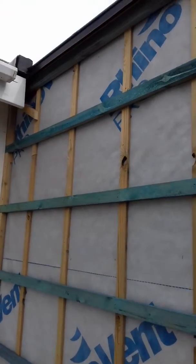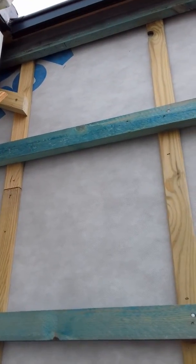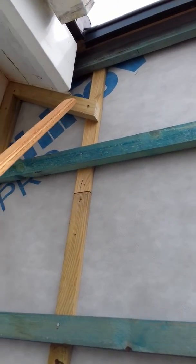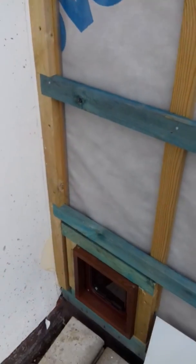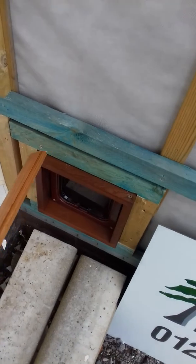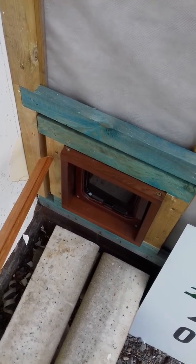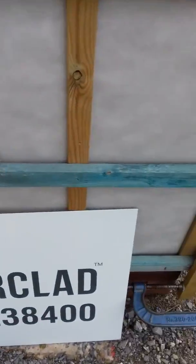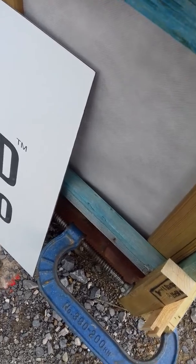come around to the end. The batten there, brown, should have been the blue one, but it closes that off, vents behind into the soffit. Come down, similar thing with the pet flap. The brown batten there should have been the blue one. Top and bottom sealed with insect mesh, just closing off, stopping bugs getting in there.